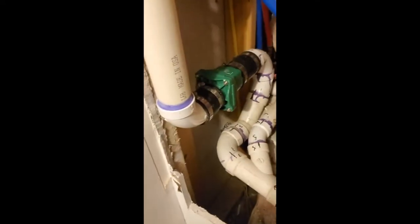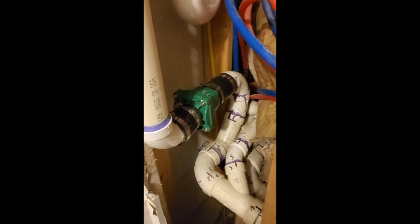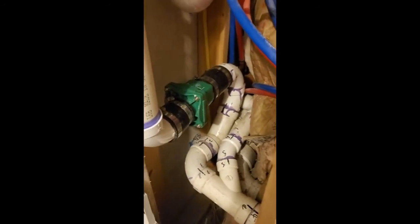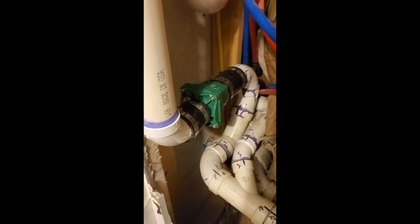As I talked about in the last video, we have a check valve — this is what we're using as our backwater valve or backwater check valve. There's a free-swinging check valve in there with no spring and no pressure behind it — it just swings freely. We can't have anything with pressure, because the pressure coming through this condensate line is only going to be trickling water. There's going to be no pressure behind it, and it's got to be able to push open that flapper and send water down into the main house drain going out to the street.